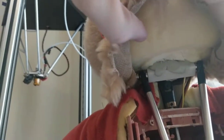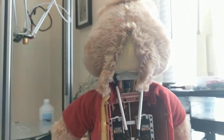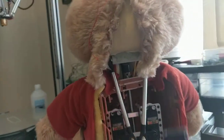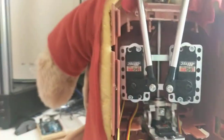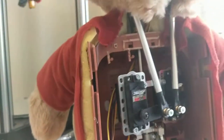In his head, it's hard to see since I still have the styrofoam on there. I just have a little piece that I 3D printed and attached to his existing structure of his head. This is what usually is holding his neck — there's this little piece that lets the wires go through. I was actually able to get this to go right through the hole that this piece originally was on, so that worked out really well. I had to do a lot of cutting and boring in his plastic to get this servo to sit right down in there, and I had just enough clearance on the left and right to be able to rotate his head around.